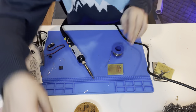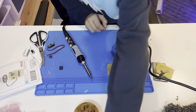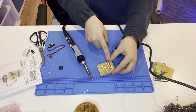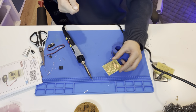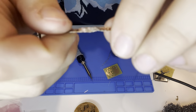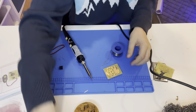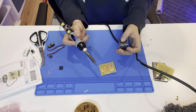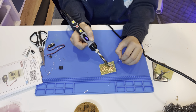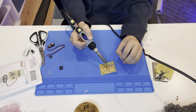What you can do is use something called a solder wick. Put it on top of the solder you melted, then melt it again — there should be smoke coming out. Pull away the solder wick and it will have absorbed the solder, leaving a shiny surface instead of a blob. Also, the solder joint is supposed to be shiny on top; when you take the iron away it will dry immediately — but do not touch it, it is going to be extremely hot.